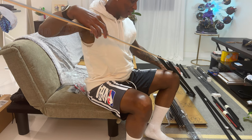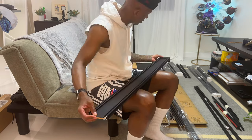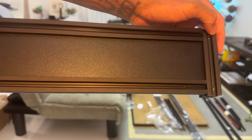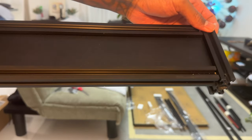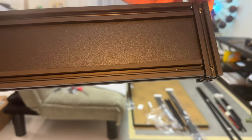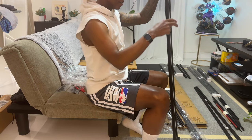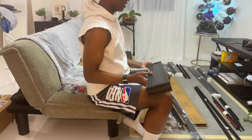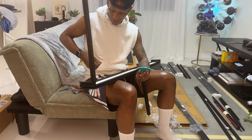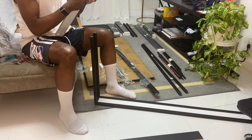The side panels just go in there like so. My recommendation on the last portion is to extend both of the top two screws out far enough that you can move the washer into the side and get it in between that joint on both sides. Then you can come over the top and start screwing it in — otherwise it can be a little tricky to line both of them up. We got one side securely in there, now we just have to keep building it out.